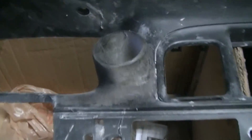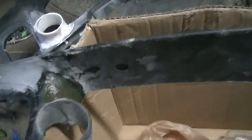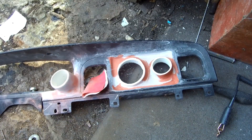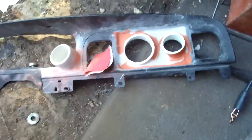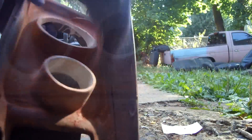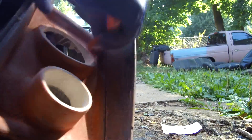This other one here was almost ready for sanding and everything. Then I had a problem with this corner — it started to lift. Again, it's plastic. So I had to go back down and really get this down right. I have to sit down with it and really get the contours right. This is where you start to reflect about all the stuff you're doing while you're sanding — thinking about the next move, trying to get the contour right. And you're not over-sanding because you're hand sanding. If you do over-sand, just put some spot putty on there and keep it moving.